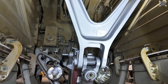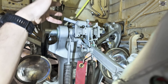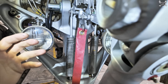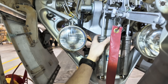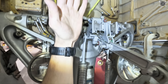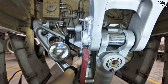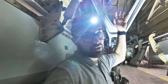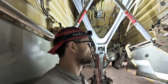So all those components need to cooperate together to keep the landing gear in position. Another important part of this lock stay, besides the actuator, are those springs. Those springs are responsible for the free fall extension - when we're not going to use the hydraulic system, we mechanically extend the gears. Those springs will pull the whole lock stay down and it will lock in the open position. The landing gear will remain in extended position and only thanks to those springs it will get there, so they are a very vital component of landing gear extension.